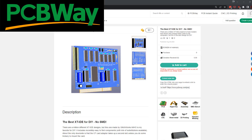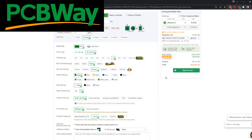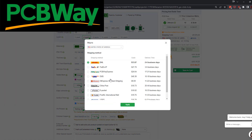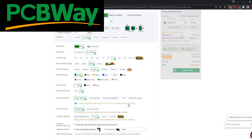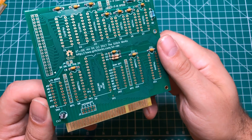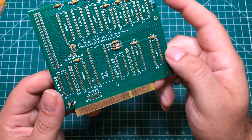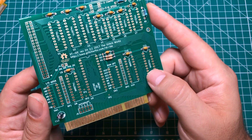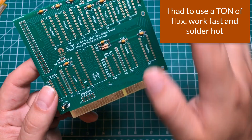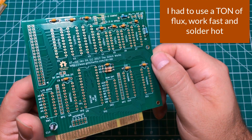I can't stress enough that there are so many revisions to this board that it can be difficult to get the right one. So what I decided to do was take the open source project and put it on PCBWay.com as a shared project. If you go to the link in the description you can click the button and get this exact board directly. I ordered these boards in hard gold, and the PCBWay people even asked if I really wanted to do that. I said yes because it makes the pins a bit stronger, but in hindsight I don't think I would do that. I'd get the cheaper tinned version, because the gold is a little bit harder to solder to — you can save money and make your life easier.